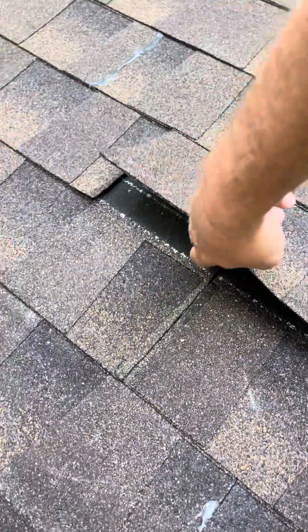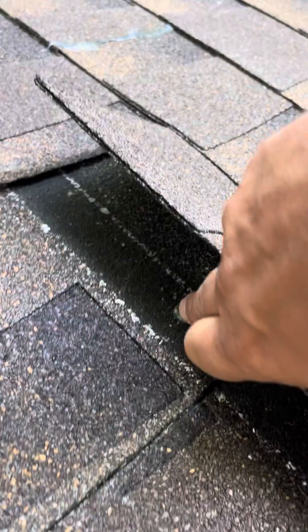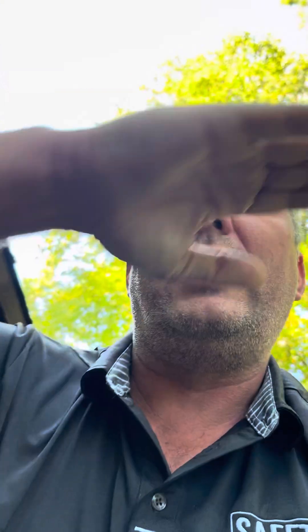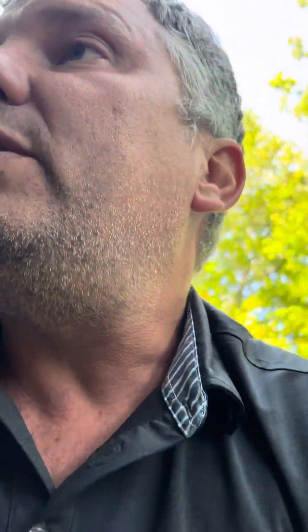Let's pull up another one right here. You put one silicone right there on that nail — that was partially right. I want to seal this gap that goes up — that's very standard — and then this nail, and I want to seal it around there all the way up so that no water can ever go in this way behind where the shingles meet. It's a phenomenon that we catch on roofs that are not all that steep. This is how you protect these roofs from leaking — you go underneath and seal it, and there are technical bulletins and specifications for sealing behind shingles. This is certainly one of them, and it is exactly what you do to make sure it never leaks.